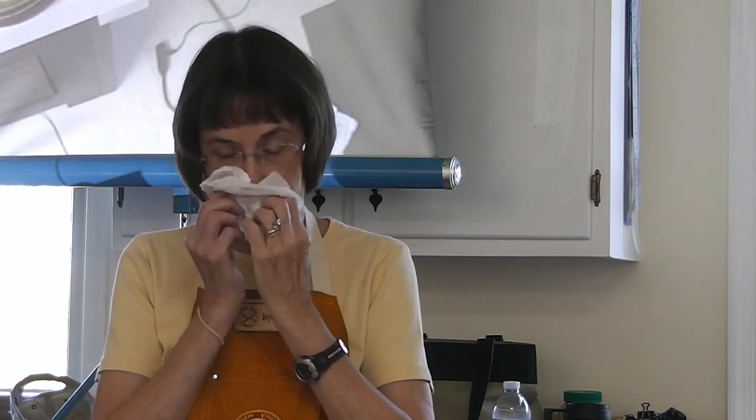That doesn't bleed. Shellac seals it. It really seals it. Yeah, just don't use a finish with an alcohol base, because alcohol can dissolve shellac.